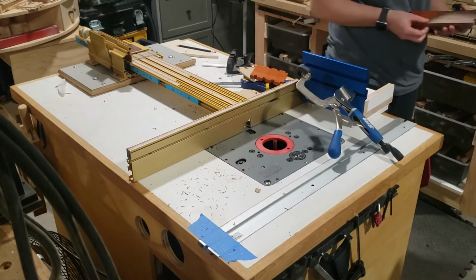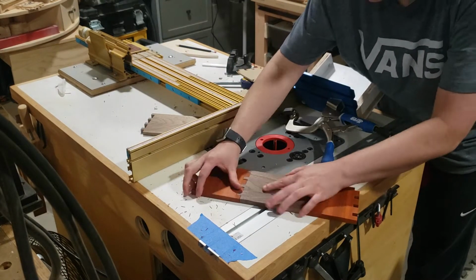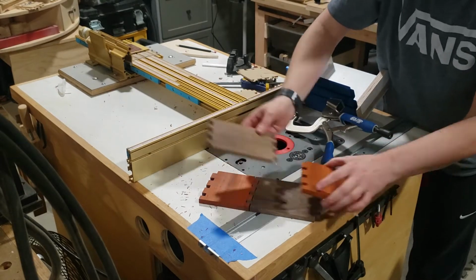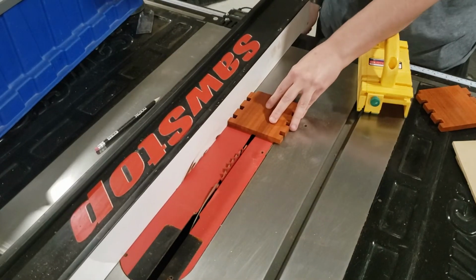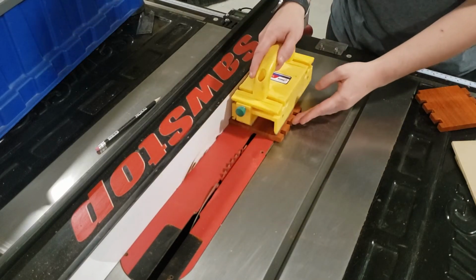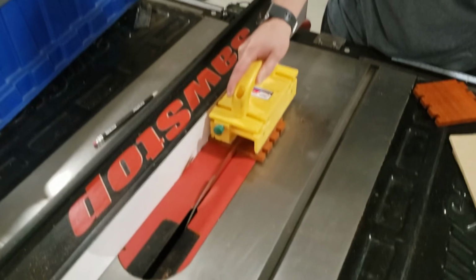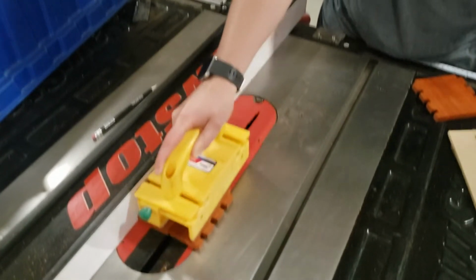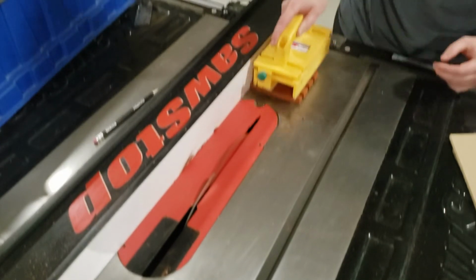All right, moment of truth, it all lined up. So that's always very, very exciting. You can see I can put pieces together. We're gonna have to cut those Padauk pieces in half here. That's how we're gonna get the 4 sides to go on each side of the walnut. They don't have to be perfectly in half. They're gonna be trimmed down later to just only about 1/8 of an inch off the edge of the walnut.